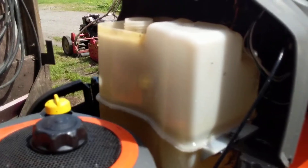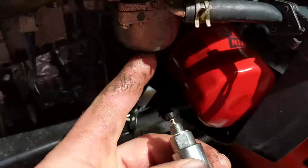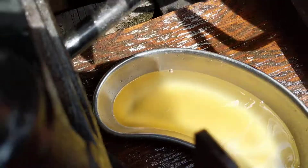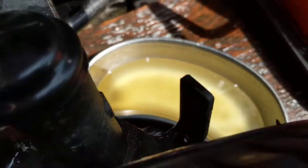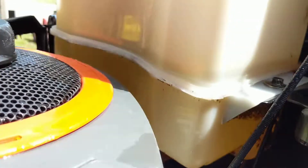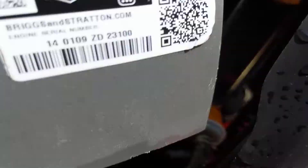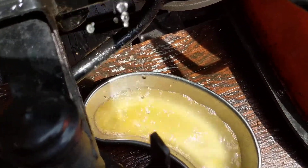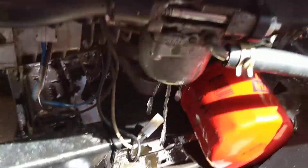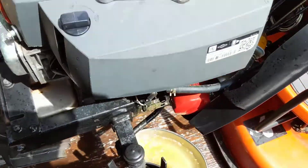This tractor was running but it was running pretty bad, so I decided to pull this out and blow out the carburetor. The fuel that poured out of this thing has got to be half water — it's absolutely disgusting. So I'm just draining out this fuel tank, it's about a quarter full, and we're going to drain it out, recycle this bad fuel, blow it out with compressed air, put some fresh fuel in, and hopefully she's ready to go back home to her owner and cut some grass this afternoon.